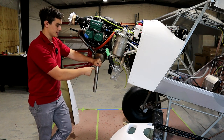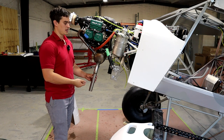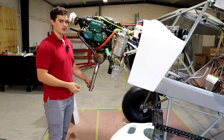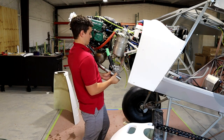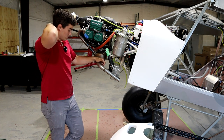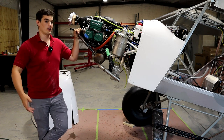For the exhaust, I'm still holding off. It typically comes straight down out of the bottom of the cowling. It has to go either straight down or straight back because you have to be able to remove the bottom cowl — going out the side would be challenging and likely to cause problems. I'm primarily thinking about pitching it back to exit at the bottom. I'll need to take it to a muffler shop to move the spring — this is just the stock Rotax 912 exhaust.